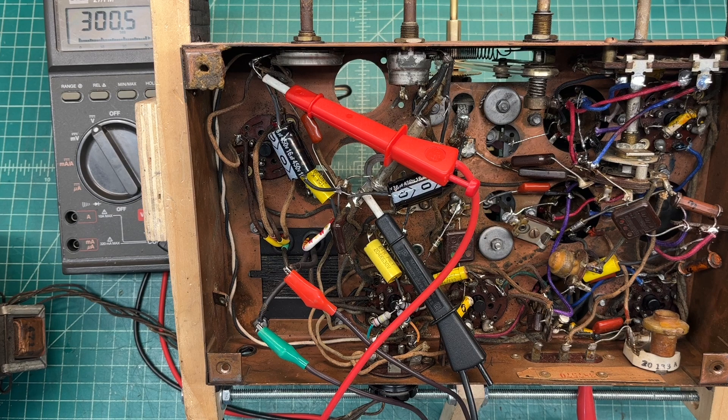The second cap is running at about — if you look at my notes — about 192.5 or 193 volts off the second cap. So a much better place. It also reduced the hum that the receiver had as well, so a lot cleaner.